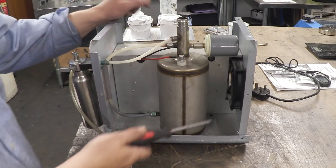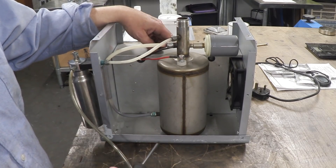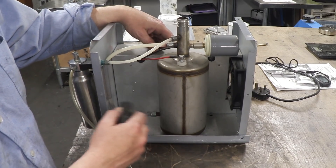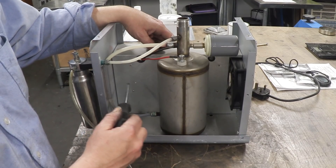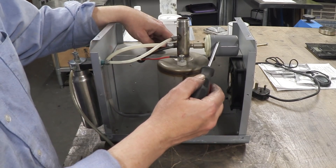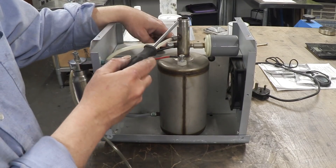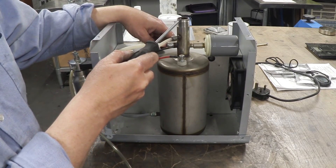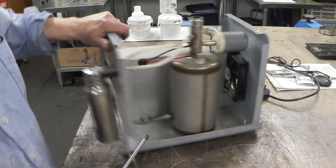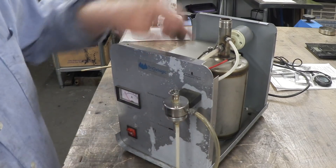There's the inside — that's clearly the electrolyzer tank. Here we've got a positive, here we've got a negative. I'm guessing it's a couple of cylinders, one inside the other. Here we've got a little bit of tubing going up to the top — that's the water fill level indicator, telling you how much water is in there. It says to put about a litre in. That's clearly the pressure valve — when pressure builds up it turns it off, when it drops it turns it back on. The electrolyte is 15% by weight of potassium hydroxide or sodium hydroxide, so it's an alkaline electrolyzer, which means this will be stainless steel.